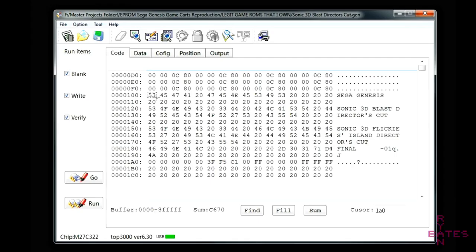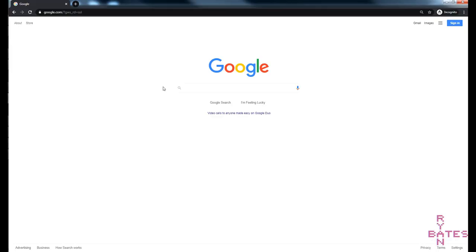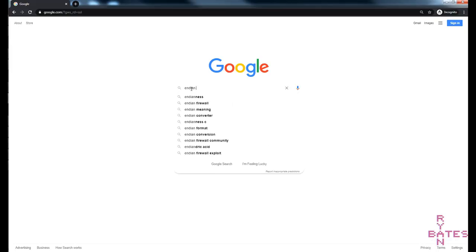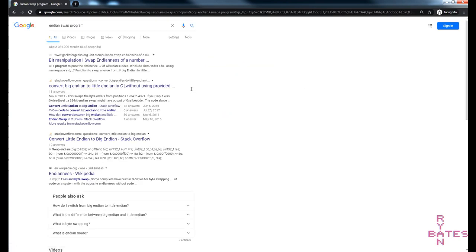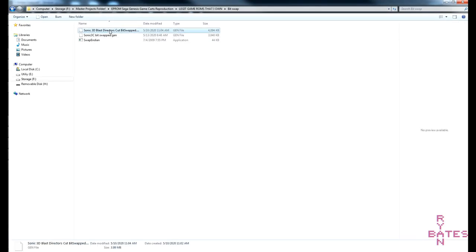Now you know we need to do an endian swap, but how do you byte swap your ROM? This was yet another step that was a bit vague when researching all of this. Most EPROM programmer applications should have this byte swapping feature built in, however, from what I can tell, mine does not. But that's okay. A Google search of endian swap program is all we need to get us there. There are a few software tools on the web that will do this for you. I found a small application that will swap whatever you drag and drop on it. I've linked it in the description.